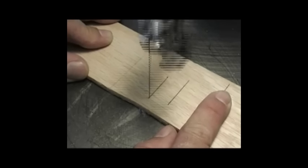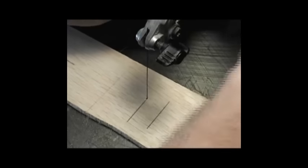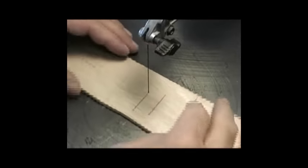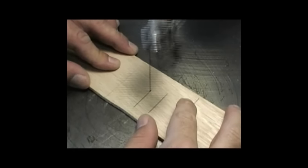You'll need a small blade for such a hole, and in this case an Olson 2.0 does the trick. Carefully and slowly follow the line with the blade, keeping in mind that such a small blade is especially prone to wandering. When you get to the end, stop and remove the blade and insert a spiral blade.